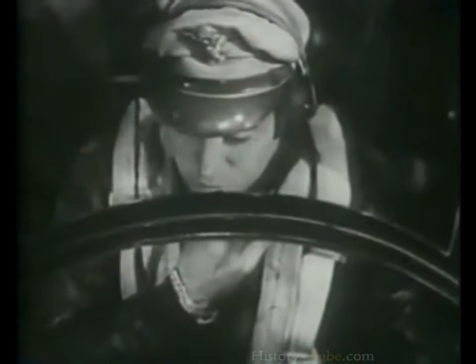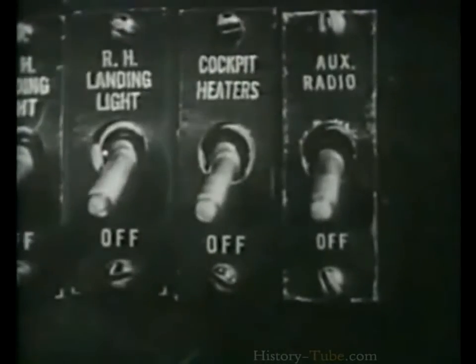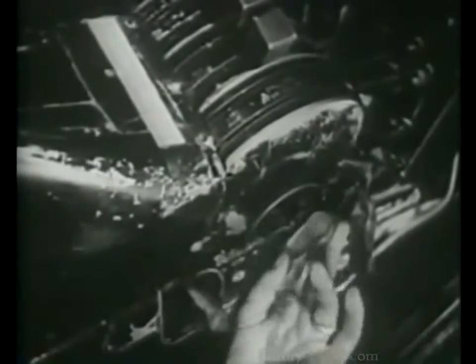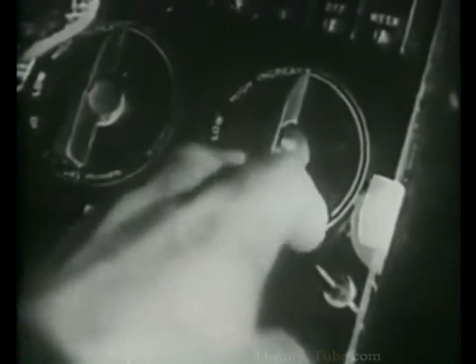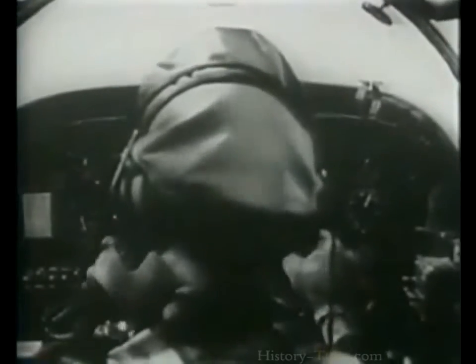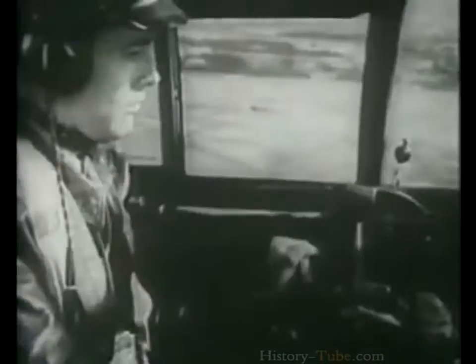Well, I guess we've been up long enough — let's head for the barn. Turn the autopilot and cockpit heaters off. Check to see the de-icer and anti-icer are off. Turret stowed. Fuel to full tanks. Cross-feed valve off. Mixture auto-rich. Fuel booster pumps high. Supercharger neutral. When airspeed drops below 175, lower gear and check it.